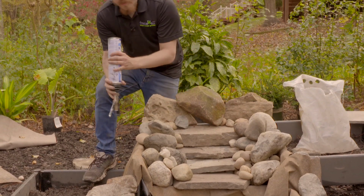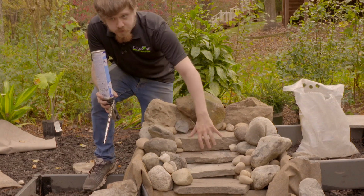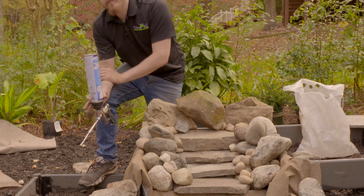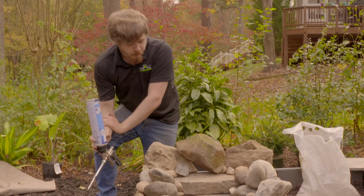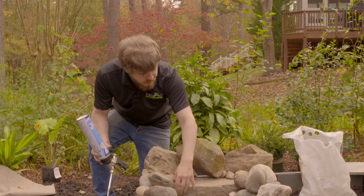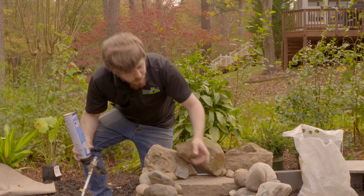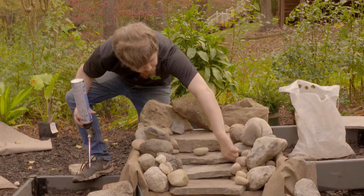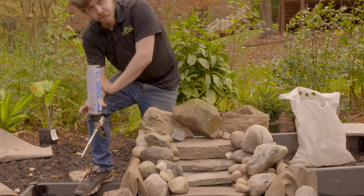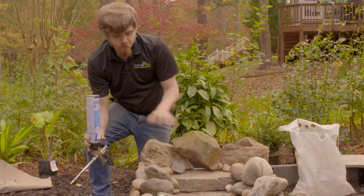What the foam sealant does is it fills in all the cracks on these little rocks here, and it forces the water down in the channel that you built. And it pretty much maintains the power of that water flow as we go. So the reason for these framing rocks is to fill in the larger gaps, and then these smaller rocks that I placed around here is just to lessen the amount of foam that we have. Because if these rocks weren't here, let's say we take away this rock, now all of a sudden we have big globs of foam that we need to place. So these smaller rocks here allow us to use a much smaller bead of foam, and really hide the foam a lot better when that water is actually flowing.